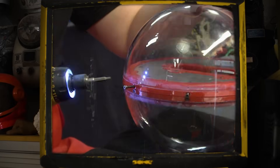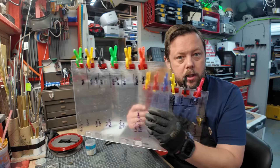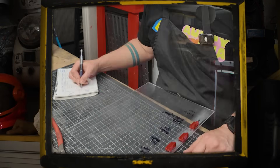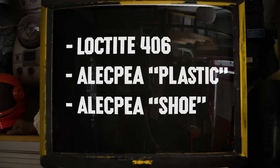Next up, I had to figure out the best way to attach the domes to the rings. My original plan was to use tiny bolts, but drilling lots of tiny holes into our brittle domes seemed like a dumb idea. Glue seemed like a good option, but I had no idea which type would bond polycarbonate with 3D printed TPU, or acrylic with 3D printed TPU. And apparently no one on the internet knew either, so I had to figure it out myself. I tested a bunch of different glues using test sheets of acrylic and polycarbonate — labeled them, tested bonds, used brightly colored clamps, and science. Some peeled off like stickers, others were pretty strong, and one was so strong I broke the acrylic sheet.